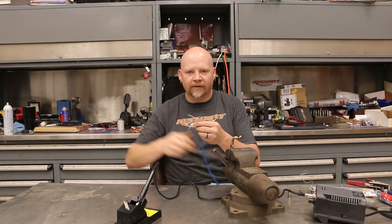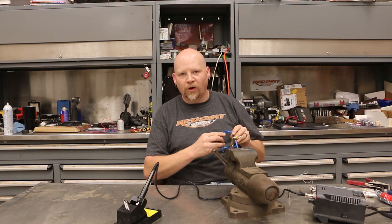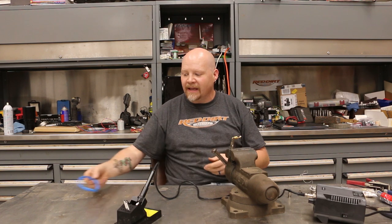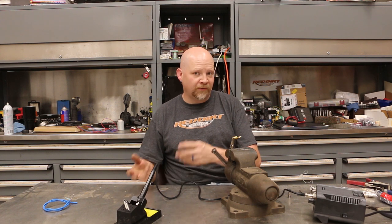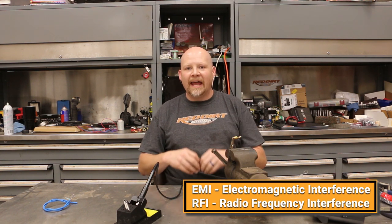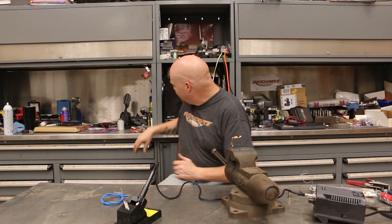CAT5 is unshielded, but the act of twisting the wire creates a shield. I take that a step further and use braided technology. This was something Ray Kimber of Kimber Cable came up with in the 70s. I've used it for years, and GM uses it on their PWM control components such as fuel pumps — they use braided technology that rejects any EMI or RF. The beauty of a braid is it gives you a 90-degree cross between your wires, which provides the most RF rejection you can get.